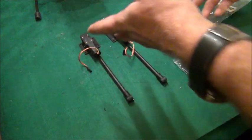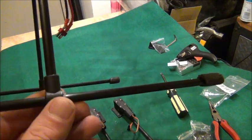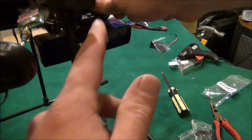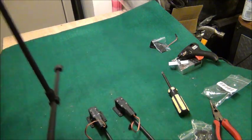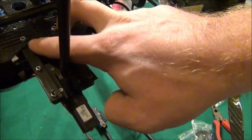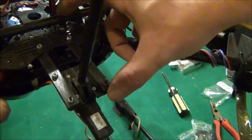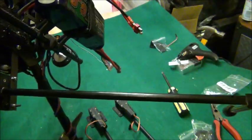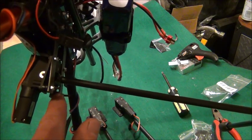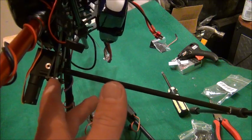All that's left is to add the bottom struts — I don't have any more of that carbon stuff but you guys get the idea. It pretty much just snaps in; I glue it so it doesn't slide, then I add some foam on the ends. Even though it looks like it shakes a little it's really sturdy. For mounting, you just need a Y-adapter. I used two pieces of flat carbon run to the frame with four nuts underneath, extending straight out a couple of inches — make a five inch piece of carbon and the retract attaches to it. I spaced it on the outside of the mount with some washers so the gear goes wide rather than perpendicular in the down position. These are 90-degree retracts, but if you can get 80 or 75-degree retracts it might be easier and you can mount them flat to the carbon.